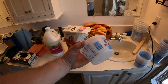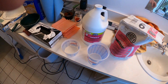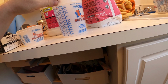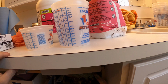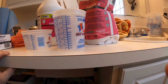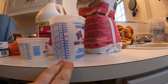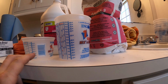So what I'll probably do, we have a little trowel, so we'll do really small batches. It's a quart. So there's the actual measurements, right? A little less than 2 parts powder to a little more than 1 part of that. Okay, so this is what I'm going to try for the first mix. I'm going to do 6, 6, 8, right? So our 2 parts will actually be 12. If it was 2-to-1, it'd be 12 ounces, 6 ounces. So we'll just go 12 ounces, 8 ounces.